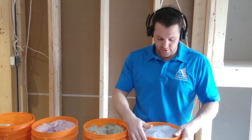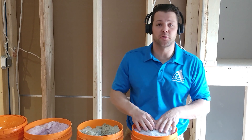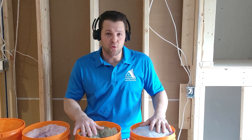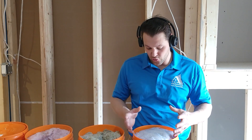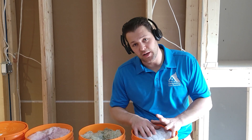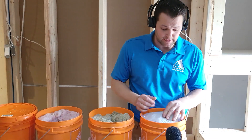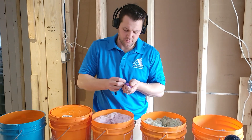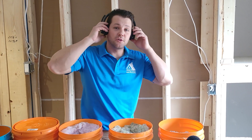I'd say the big winner is the dense fill cellulose. The reason is because this is a machine application — it's also much denser than your regular rock wool. There are no gaps, no air, no mistakes that can be made. The fiber is organic, and organic fibers are better than artificial fiber at catching the sound. Let's see our next video to learn more about the dense fill. Thank you for watching!